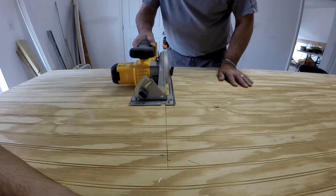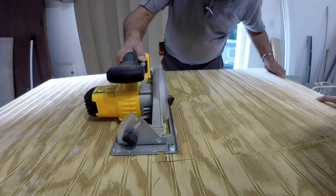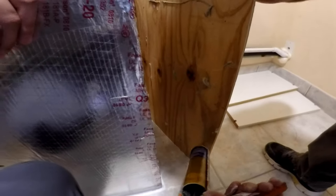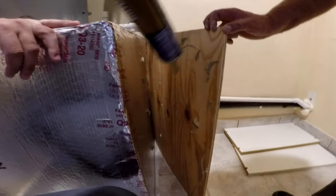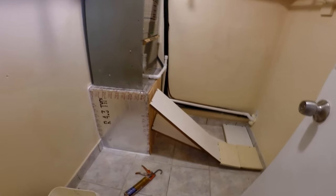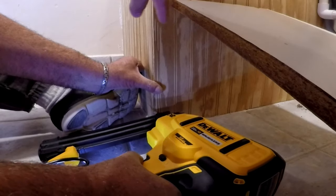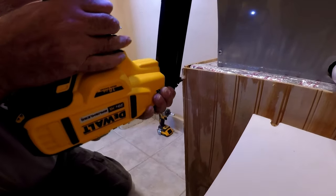Using the decorative quarter-inch plywood again, we cut two panels to fit the exterior of the air return box — not only for cosmetics but to protect the insulation board that was used around the metal frame which holds the unit off the floor. I applied it to the insulation board using construction glue and used lumber to hold it pressed in place. I repeat the same for the other side and brad nail the corners of the two panels as well, then we wait for it to dry.